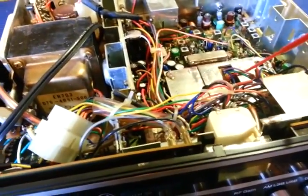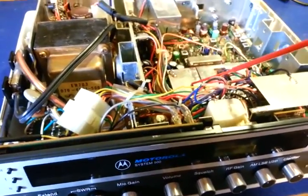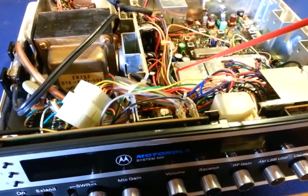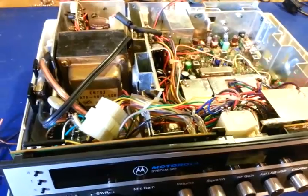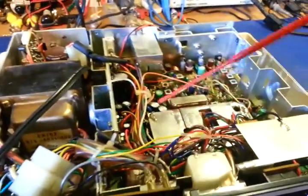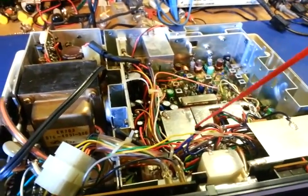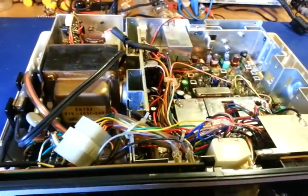There was no reason to be using tin snips to whack holes in those cans. Once I had the chassis pulled, it took me a minute and a half to get the can out — unsolder the capacitor, unsolder the ground wire. With a proper desoldering gun it was just a matter of sucking the solder off the five tabs that passed through to the ground plane on the underside of the circuit board.